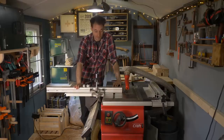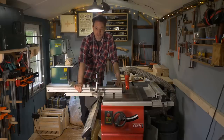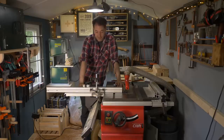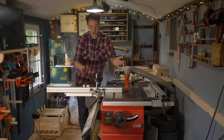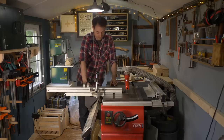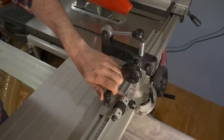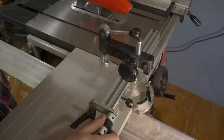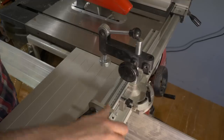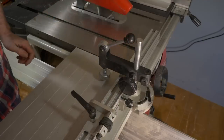Let's move on to the accessories, starting with the sliding table. I wasn't sure whether to get it because of the workshop space, but I'm so glad I did - it's allowed me to get rid of my mitre saw station and now I use this for both rip cuts and cross cuts. It's on a mobile base so I can turn the saw around for longer pieces. The fence goes up to 900mm and has a nice flip stop with a micro adjuster, which I found so useful for when you cut something slightly too long and need to dial in that cut. It's got a very quick cam-locking clamp which is great for sheet goods.